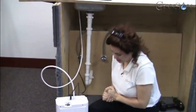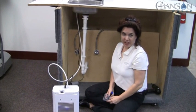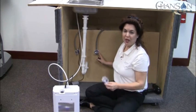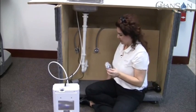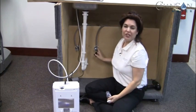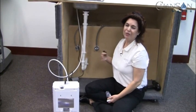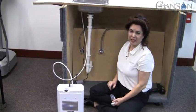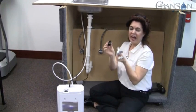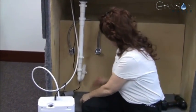We have about half of our install done already. Now we're going to install our T diverter valve on the shutoff valve. It's not that difficult, but what becomes a little confusing is that we have three to choose from with a couple of different sizes. We've tried to provide you with a standard size of everything you'll need. Some rare plumbing issues may require a trip to Home Depot for a different valve — it's called a T diverter valve. These are half-inch valves and this is a three-eighths inch valve.